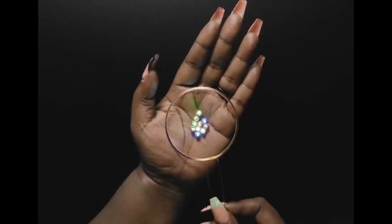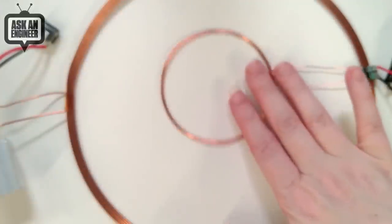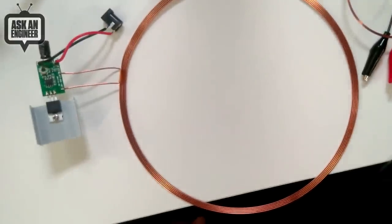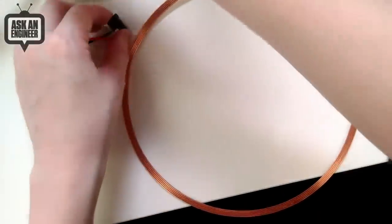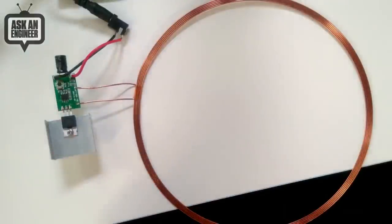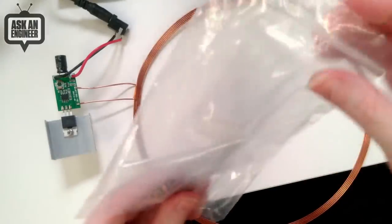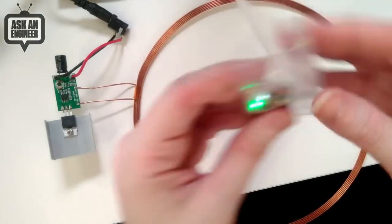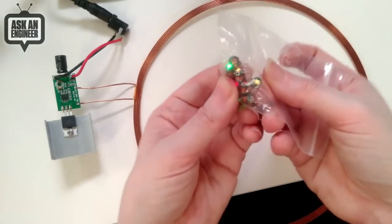So here's the big coil versus the small coil. The big coil can transmit a lot more electromagnetic energy, but the trade-off is you need to power it with a lot more voltage and current — instead of five volts, you need 24 volts. We do have a 24 volt power supply, though be aware it's not a common voltage people have on hand. The bigger coil is fun because you can put LEDs further away and in the middle, and there are lots of fun possibilities — people are already talking about escape room projects.